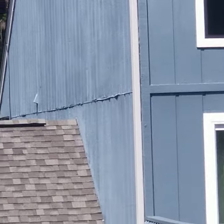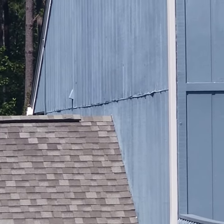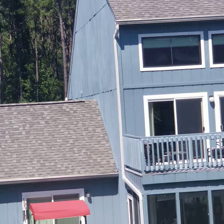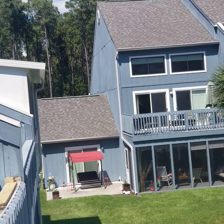You see that side? That's without it. So when water gets in there through those open ends, it starts expanding the wood over 10, 15, 20 years. These buildings were built in '86. The water gets in there, starts expanding the wood, and eventually gets in the wall.